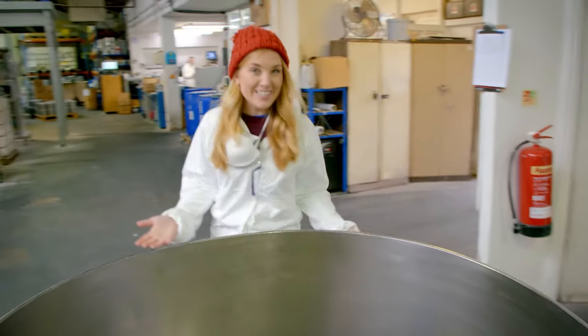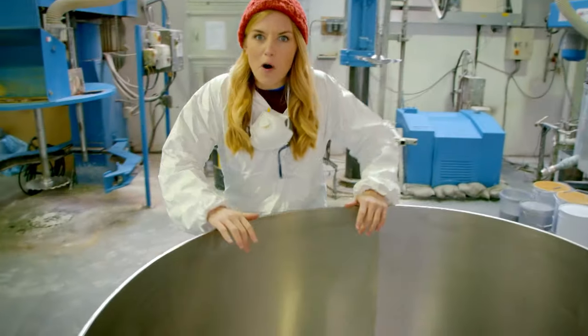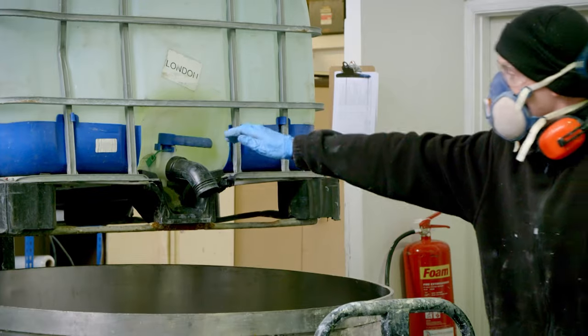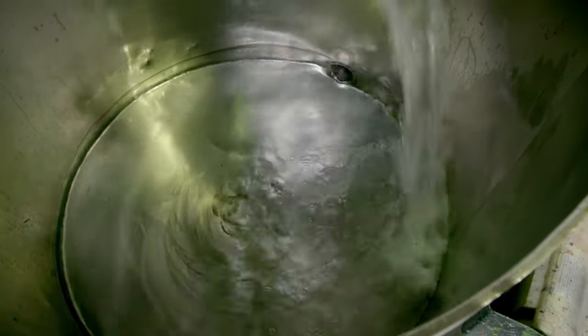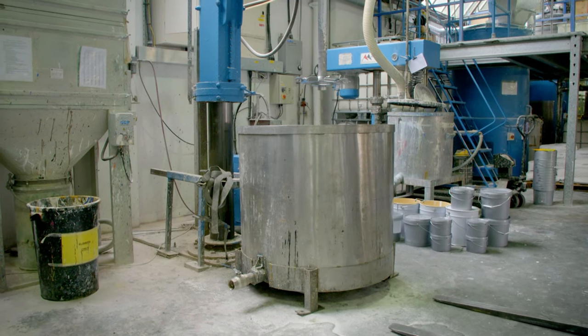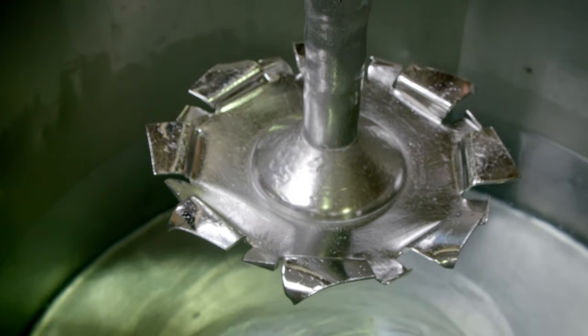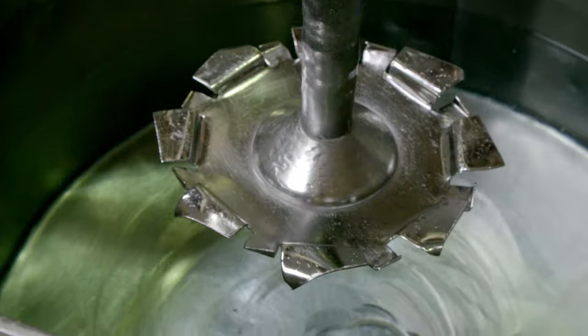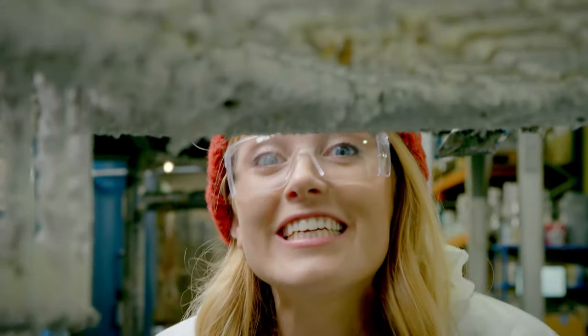Because even most coloured paints start out with a white base. Next, all of the wet ingredients are measured and put inside this big silver pot. The main wet ingredient is water, and this batch of emulsion needs 350 litres of it — that's enough to fill four bathtubs. The big pot is called the disperser, and the disperser blade gets lowered down into the pot where it will spin round and round to mix all of the wet and dry ingredients together.